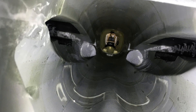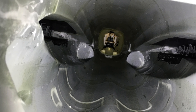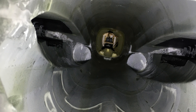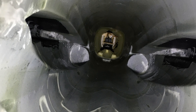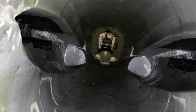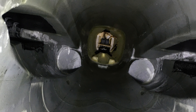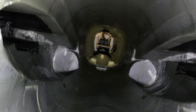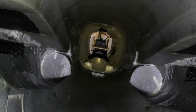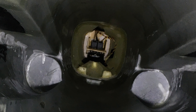With everything bolted together, looking from the nose to the tail on the inside, you can see on the sides where the seams are that the resin has cross-flowed, which has given me a good weld. The tail section is all nice and tight with no run-out, so everything should be good. I was also able to put a brush on the end of a long stick and apply tape to the seams, so the seams have now been over-taped over the welds. Everything is ready to pull apart and split out once the resin dries.